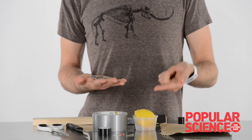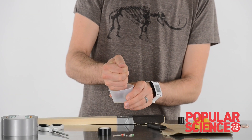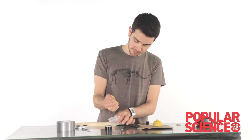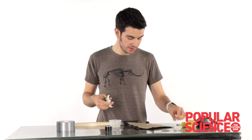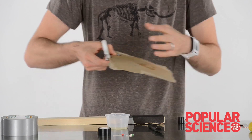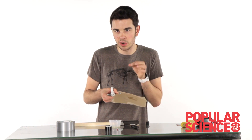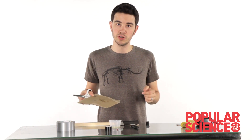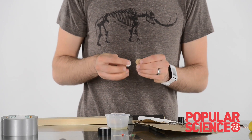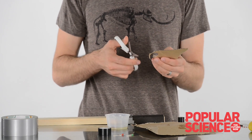What we're going to do now is cut open this lemon, squeeze out the juice, and get us some acid for a chemical reaction. It doesn't matter if the seeds are in there — all you want is the juice. Now you want to size the cardboard to the size of the penny. You don't want it extending beyond the penny because then you can have a mini short going on; it needs to be slightly smaller or exactly the size of the penny. Then we're going to dunk those in lemon juice for a little bit. That's about the size you're looking for — penny size — and just toss it in there, until you've got seven of these.